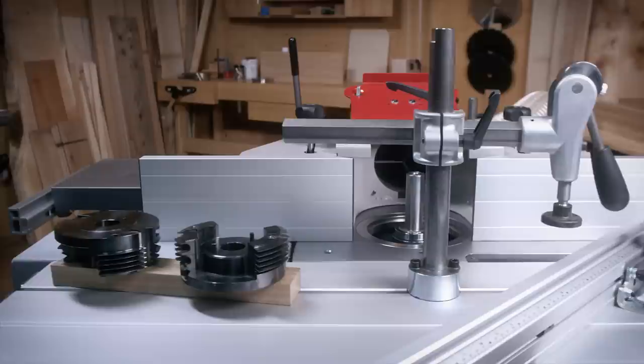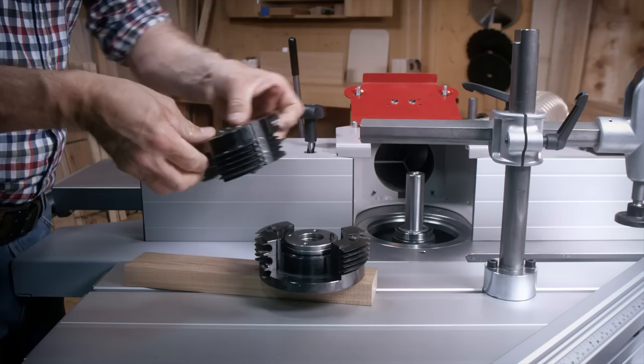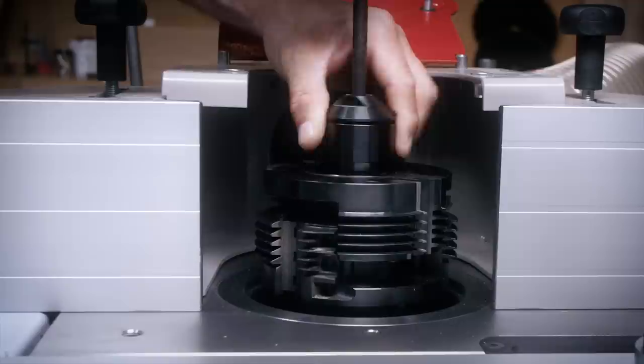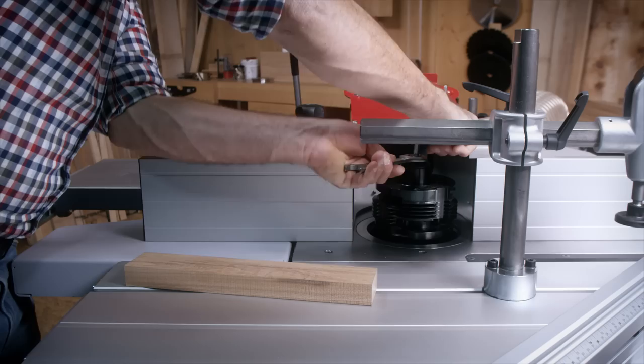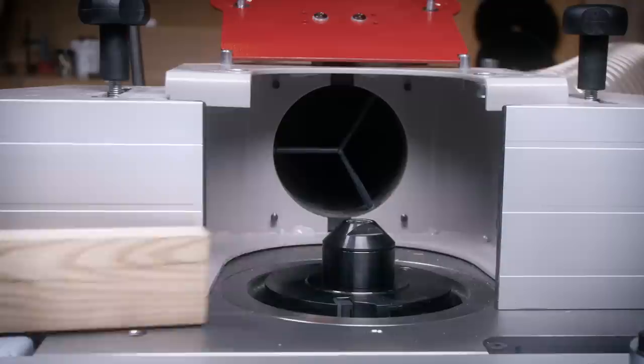To achieve the maximum number of mini V-teeth, we adapt the number of insert rings. The dimension of the milling tool is thus adapted to the thickness of the wood. In our case, we use 2 ring inserts. For adjusting the spindle height, we took a mathematical approach. In other words, we marked the wood with the cutter knife to determine the zero point.